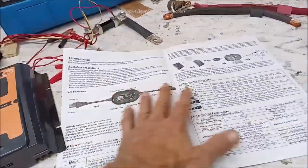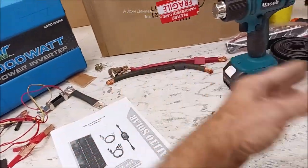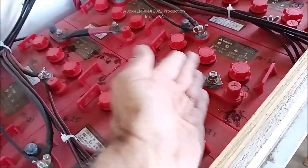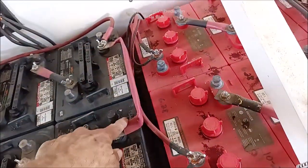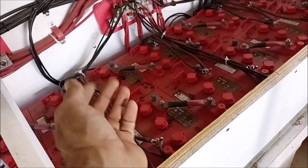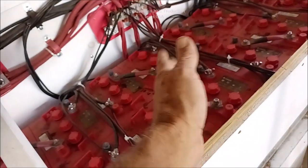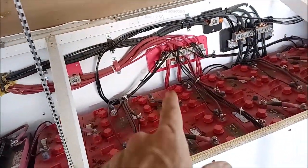Make sure you look at the previous video where we show a beautiful solar setup for beginners — learn the easy way first, then move forward. Out here you have a positive and a negative side and you identify those — it makes servicing the battery so much simpler. This is joining six-volt batteries right here, and you see where we bridged two full banks of batteries using just type L copper. It will handle about 400 amps, so if you're talking about a 230 amp-hour battery, you've way exceeded your needs — even with 300 amp-hour lithium batteries in series or parallel.